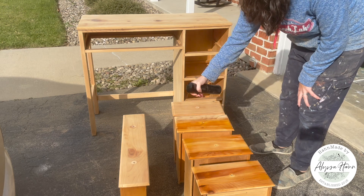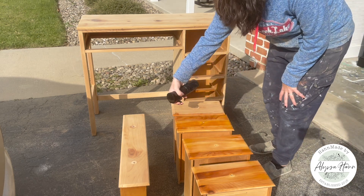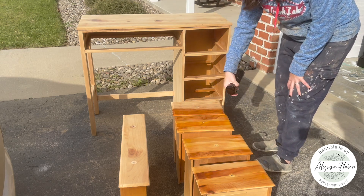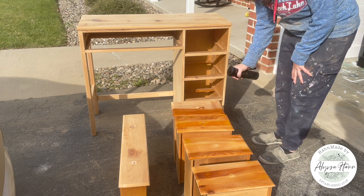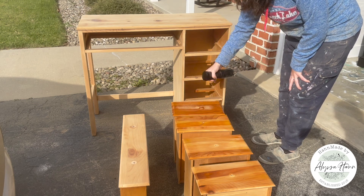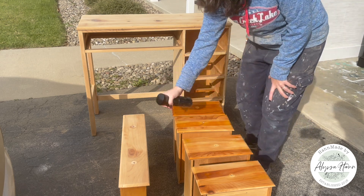So today, we're going to mimic the look of bare wood but with products. I'm going to bleach — they do make bleaching kits for furniture, however I wanted to give it a shot and use what I had on hand, which was household bleach. I used a solution of 50-50 equal parts bleach and water in a spray bottle.